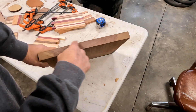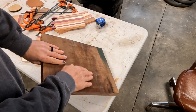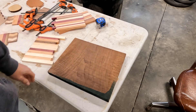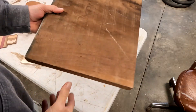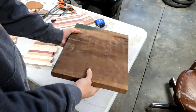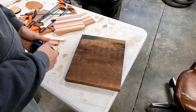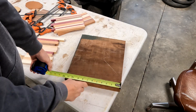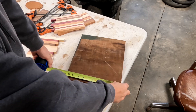I'm trying to get nine by seven and three-quarters thick, so I picked this piece of wood. I can tell which way my grain is going. You can see there's a slight wobble in the board, so I've got to plane that out. If you don't have a planer, you can sand this out or find a nice flat piece of wood. The wood is almost an inch thick, so it gives me room to plane it down and make it nice and flat.